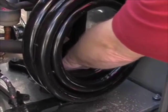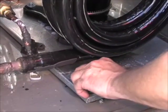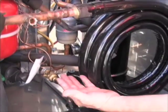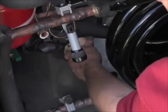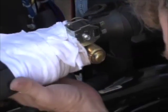There's a bracket on the very back — we'll show you once we remove it — but there are two bolts holding the coaxial to the floating vibration mount, the same as the compressor is attached to the plate. So remove those two bolts, disconnect the refrigerant lines, disconnect the water lines, and then this coax assembly is ready to be removed. We've wrapped a wet rag around our thermal expansion valve — protected from any heat. I've also wrapped some wet rags around the insulation around our reversing valve, to minimize any damage and fires from the torch.